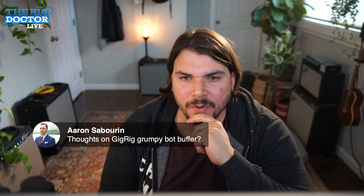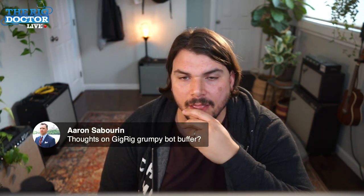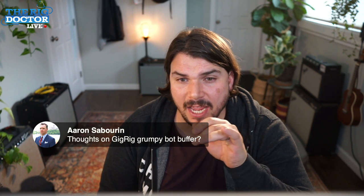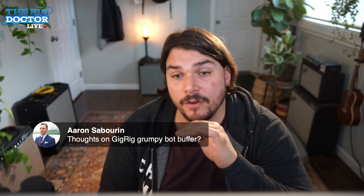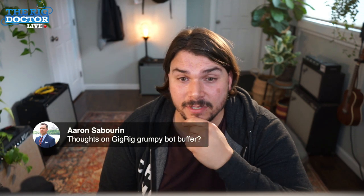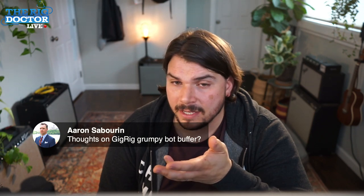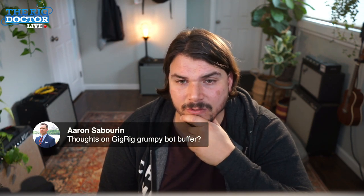I think it had a 1 meg input, which is good, but had a 1K output. Normally you'd want between 80 and 150 ohms. This was 1K, so that would mean it's 10 times higher than what was recommended. I don't know if this thing has the same output impedance, but typically there are little small guys, and I haven't found any of them to be in that spec.